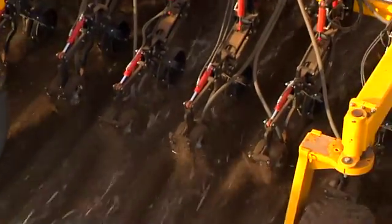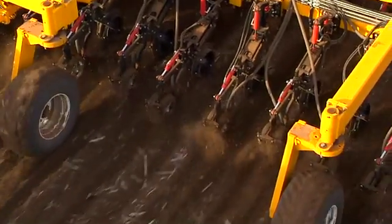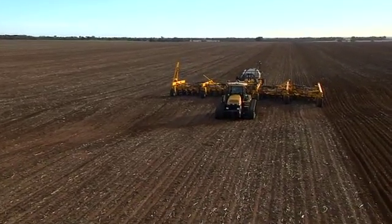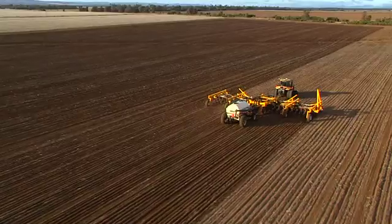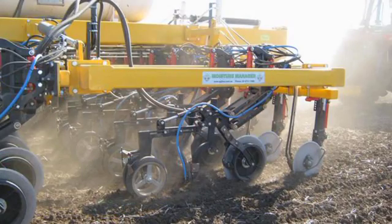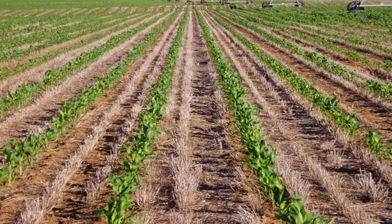Being able to place that seed at the right depth in the soil with the right pressure of the press wheel — and there's a huge variation in press wheel pressures required for different seeds in different soil types. You do need some brute strength in machines for no-till, particularly when we get into moisture seeking where we're chasing seeds like chickpeas down at eight inches or 200 millimetres of depth. But we've also got to have the ability to seed at shallow depths when seeding fine seeds like canola and grass seeds, so we wanted to be able to do all of those with one machine.